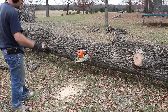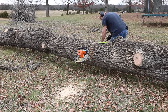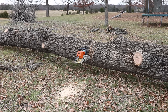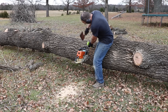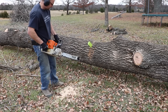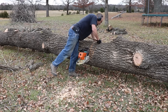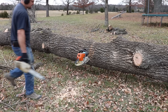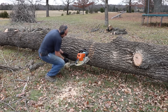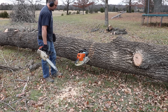The chain is hopelessly pinched now. So what can you do? A couple of things. You can take some wedges and open that saw kerf back up — that requires lifting up the whole tree. It actually worked — so that's one option. The other option is to take another chainsaw and do a proper cut nearby — come over here and cut from the bottom. Once all the way through, this wouldn't have all that tension on it anymore and I'd probably be able to get my saw out.